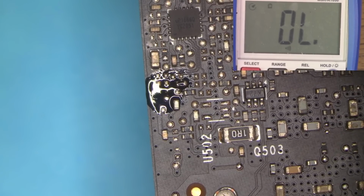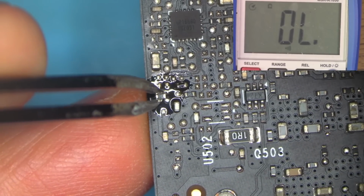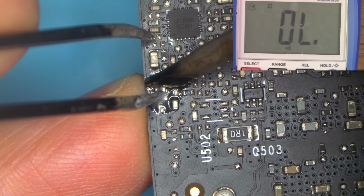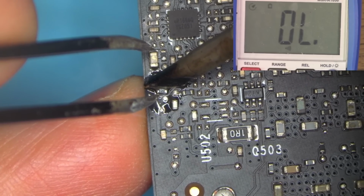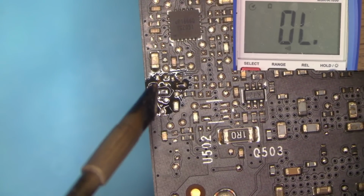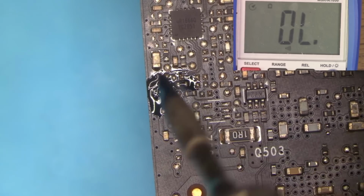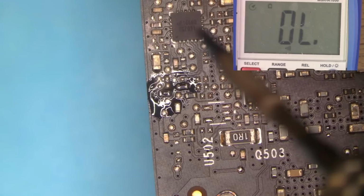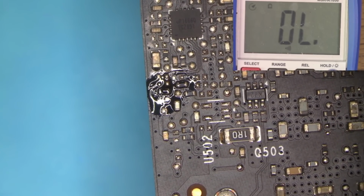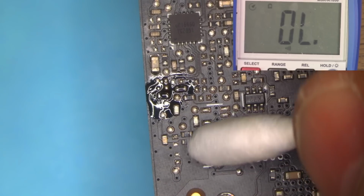And we're going to bring in a 0 ohm. If something happens and there's some kind of a short, that resistor might save the board, whereas wire most likely will not, because chances are the resistor will blow long before any kind of damage is inflicted onto the board. So we have that soldered down. So actually we did have to do a repair after all, huh? That's incredible.